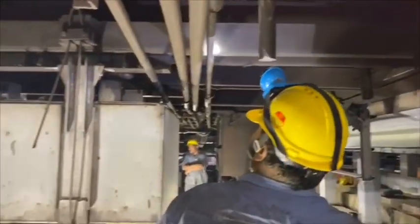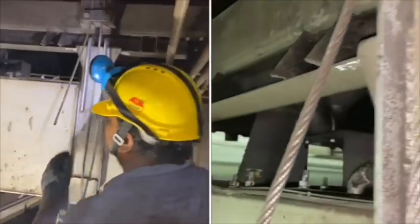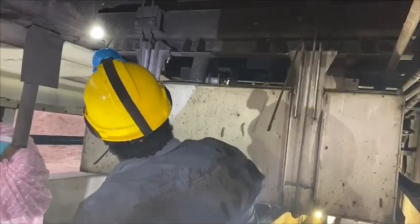When it comes to the biotank, check the condition of biotank channels, mounting brackets and their fasteners. Check wire rope brackets, weld failures, and wire rope for slackness.